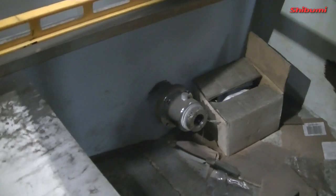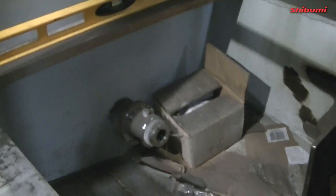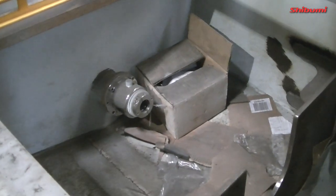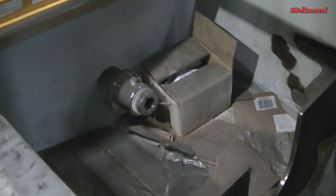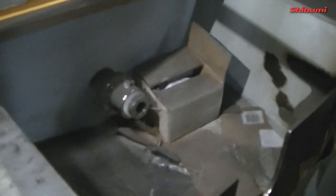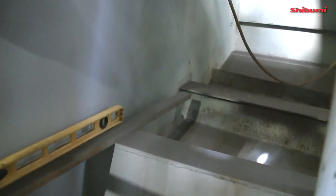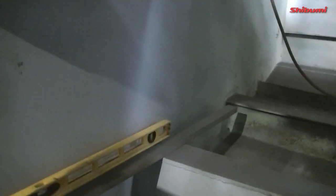Now, rather than go directly above it, which I would have shown in a couple of videos back, there's a whole arrangement and a breather, I'm going to remotely mount that on this side, because in here as low as I can is going to be the exhaust muffler, which I showed you before, and that's going to sit really as low as I can to get the angle off the manifold of the exhaust down in a curve down into the muffler, and then the top part of it then shoots it out and into that corner over there through the back wall on that new pipe that I've got, and then out through the back of the boat.